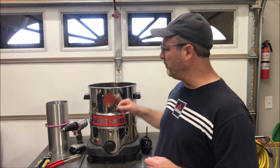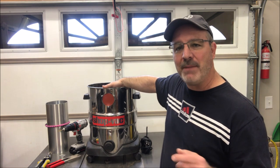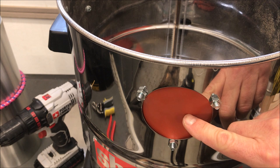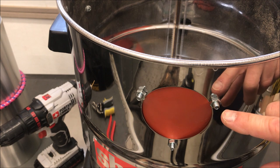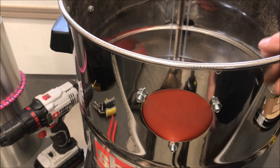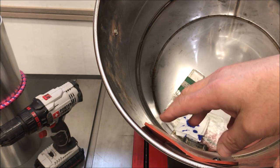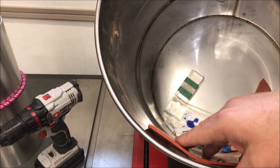It's working out really well, but there's one issue — you can see this red area where there's a hole. I took a piece of rubber and attempted to patch that hole, but I don't like the patch job. Looking at the outside, I used screws and nuts to hold the rubber in place, and with the screw sticking outside of the canister, as you're kicking this around with your leg you could literally snag your leg on it. Also, looking inside, when I tightened the screws it pulled the rubber and caused it to lose its shape and pull away from the can.